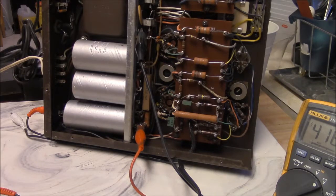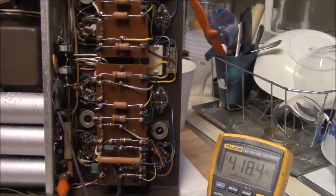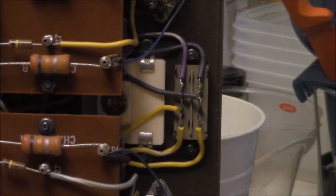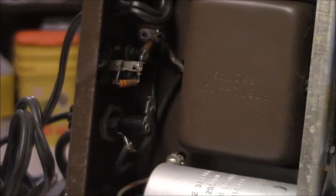The other thing that I personally don't really care for is this little basic meter. There's the switch in the meter circuits to help you adjust the bias on the thing, to help you adjust the balance. And there's also a little test point on the back of the amp. Let's see, where is it? Right there.